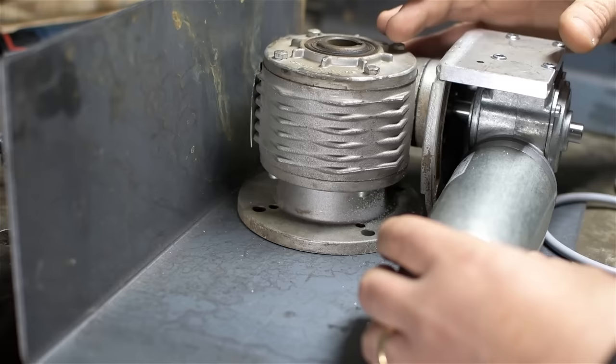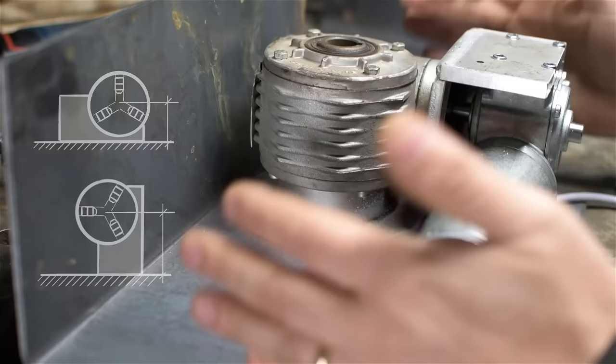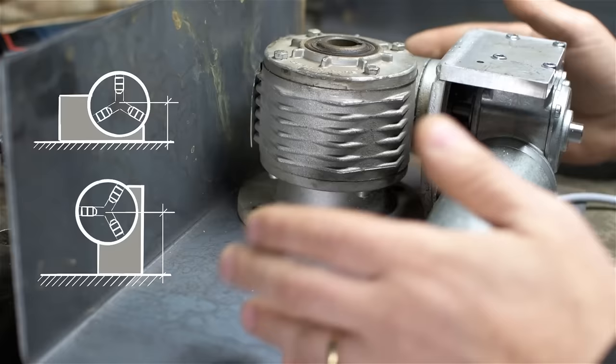On the mechanical side of things, I'm somewhat constrained by the fact that I have such a large offset, but that was done sort of by design. I want this offset so that when I flip the box up, either for horizontal or vertical welding, I have an offset off the top of my bench. And potentially I could add larger turntables to the top, a larger platen.